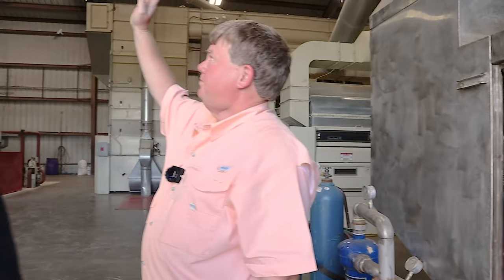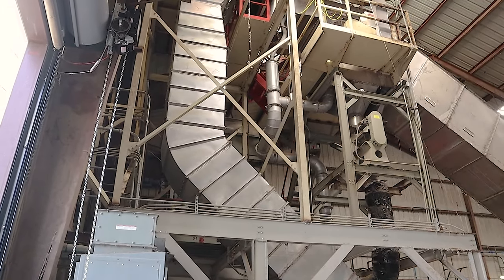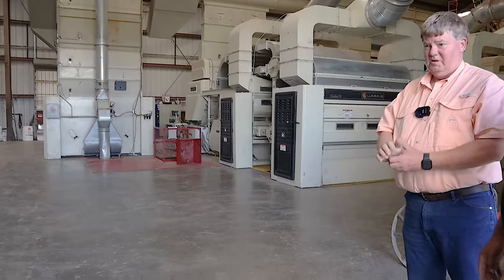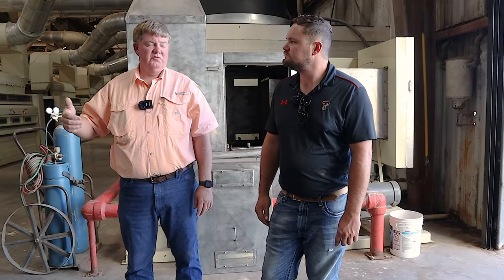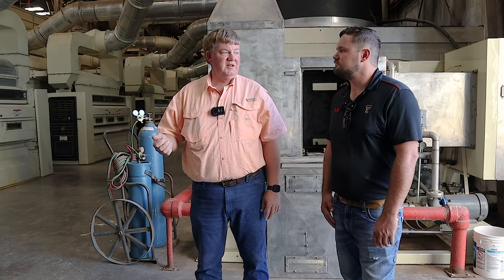As you've got that bat of cotton coming down, we're pulling through the bat of cotton. So the cotton is capturing the moisture and sticking it in there. By the rule, you can have 7% moisture in your bale. And most of what we gin is gonna be 5.5 to 6. So if we add just 1%, we're only adding 5 pounds to a 500 pound bale, but that's 5 pounds that, especially this year, if you've got $1 a pound cotton, that's $5 a bale.